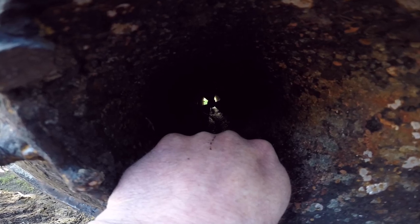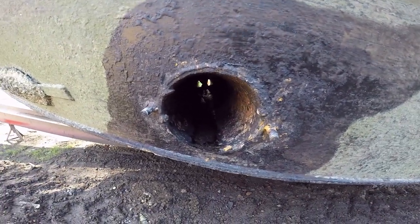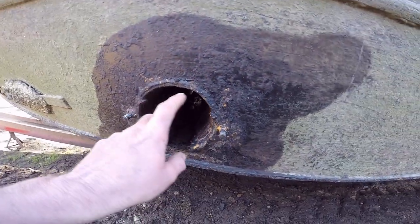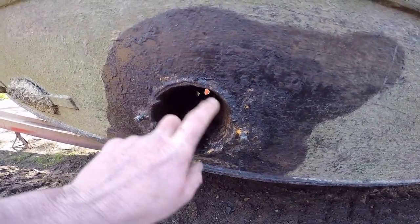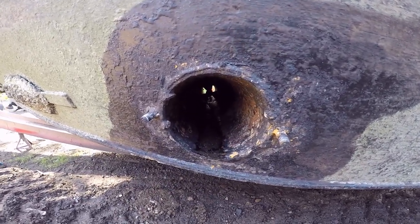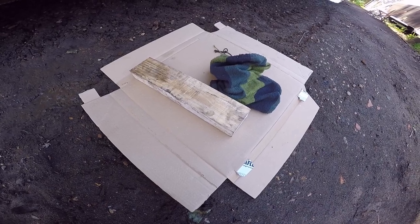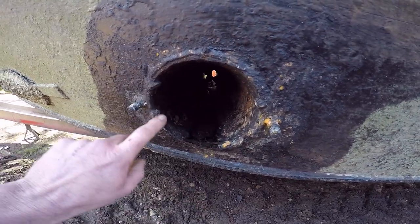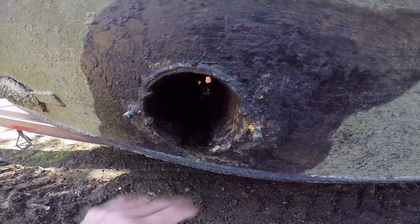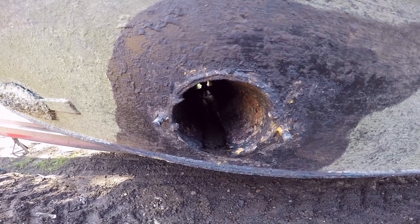The man came in the other day said he was sinking and needed to get pulled out quick. He doesn't want to put a new tube in, so what I'm going to do is cut two circles - one each side - set them in just a little bit, weld them up, and decommission that tube. I've got some cardboard and a piece of wood to help make a template, but first I've got to cut off these studs, clean up this hole, make the template, then play with the new plasma cutter I've been bought. Happy days.